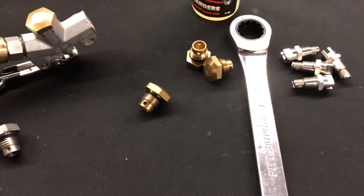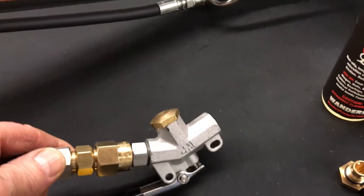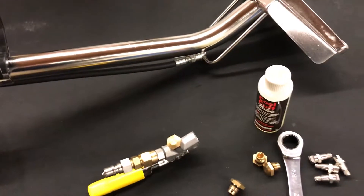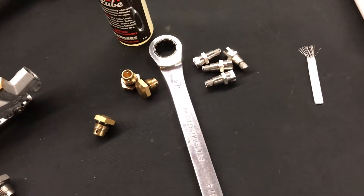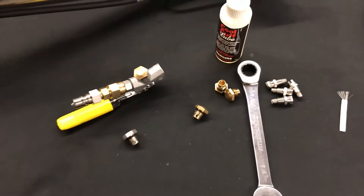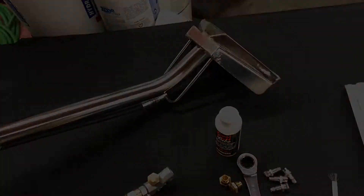Are any of them telling you guys about the brass hex cap? Nope — I'm the only guy in the industry reminding you. This guy is thinking ahead before winter and he's doing it. They ought to come stock, but that's not my valve. So you've got your winterized soft touch — theoretically he'll be safe if he screws up and leaves his equipment out in the truck. Use a little cool cuff lube when you screw the brass in so it doesn't squeak. He's got extra 110-15 jets with jet screens because they do clog, plus a jet cleaning tool — or he can change them out with the custom wands: one hand on the spray bar, other hand on a half-inch wrench, back out a jet and change it in about a minute. He's all set — thanks Grossman.